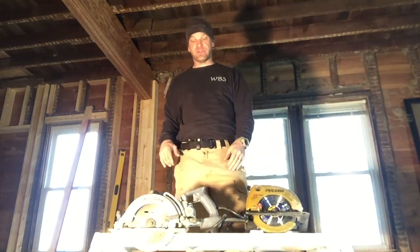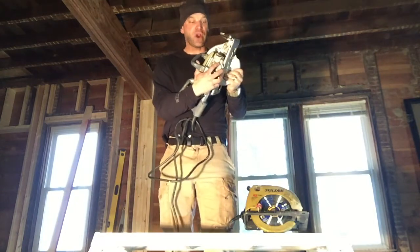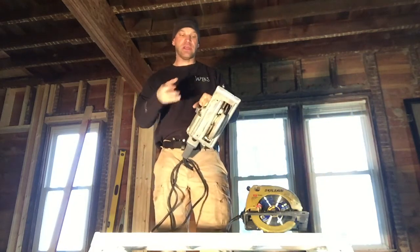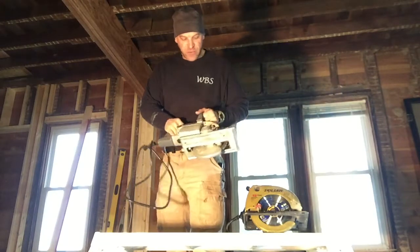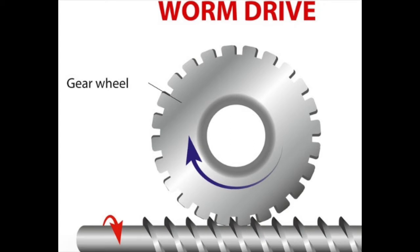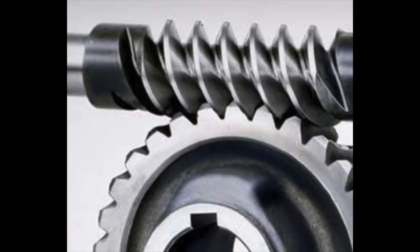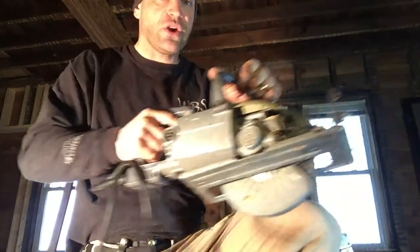The other type of circular saw is what's called a worm drive. This is called a worm drive because it has a worm drive gearing in this saw. A worm drive is a series of gears that build a lot of torque into the system. This has an electric motor also, but what makes this really special is the gearing inside this casing. Some gears turn and that spins a cylinder or spiral type gear, which in turn makes the blade rotate. This is really good for producing a lot of torque — you can really just cut through a whole bunch of stuff.